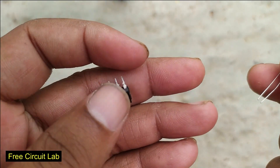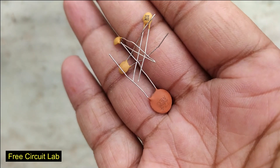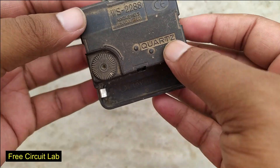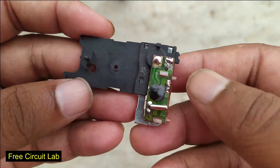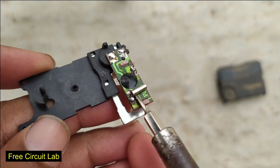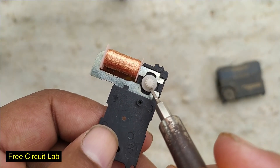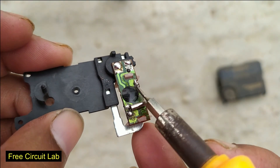To make it we need a suitable clock which features a stopwatch. Most digital watches also have the same circuitry and will work too. We need the main core component: a 555 timer chip. Since the caps are very tiny they will generate high frequency, which we cannot feed directly to the stopwatch, so we need a frequency divider. One such circuit is found in analog clocks — this circuit has a crystal inside which generates around 33,000 pulses every second, but its motor gets triggered once every second, so there must be a counter tracking the input pulses.